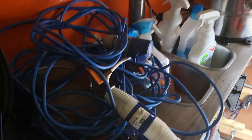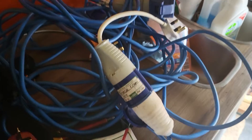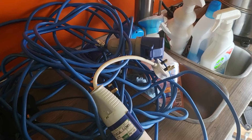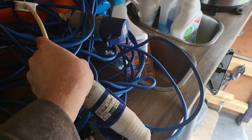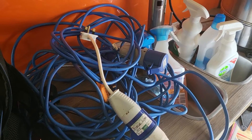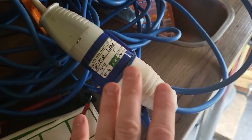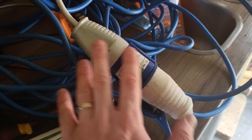Also with these trucks, you'll need to be carrying most probably your 16-amp adapters. The reason is a lot of these trucks have hook-up or fly leads, as they're called, to plug into generators on site. This particular one has a 13-to-16 adapter so they can run this cable into wherever they are to get mains power, then plug it into their trucks. Obviously you're going to have to test the adapter and you're also going to have to test the fly lead separately, not forgetting on these 16-amp connectors that you must open up the connectors to perform the full visual inspection.